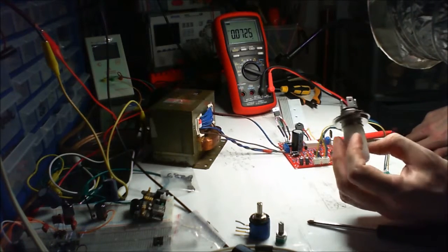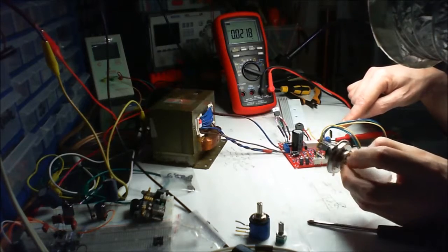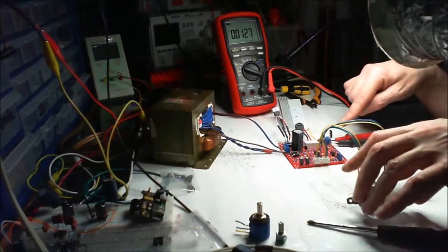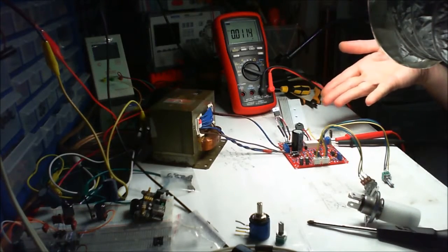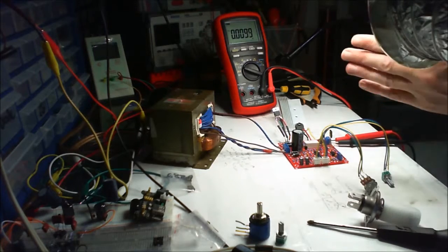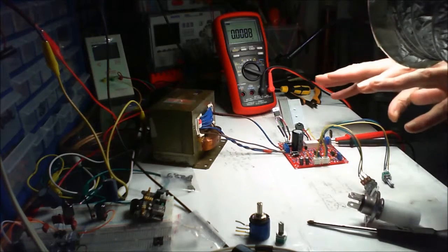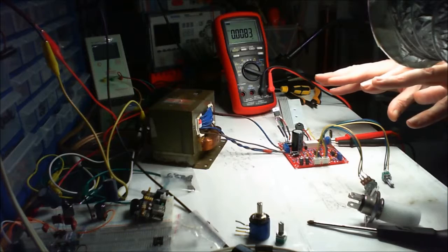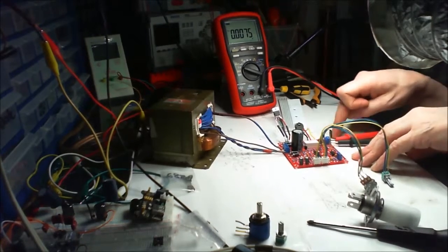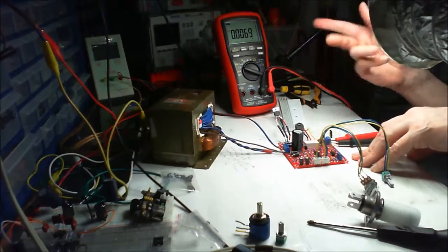I want to do this light bulb, but I think the problem is, if I remember, these D882s, I think their output regulation is like 1 amp or something. So I'm not quite sure how this actually works. This is supposed to be 0 to 30 volt, 0 to 3 amp. So we're talking about 60 watts, right? No, we're talking 90 watts. If this was running at 30 volts, kicking out 3 amps, that's 90 watts, yeah? 30 times 3.